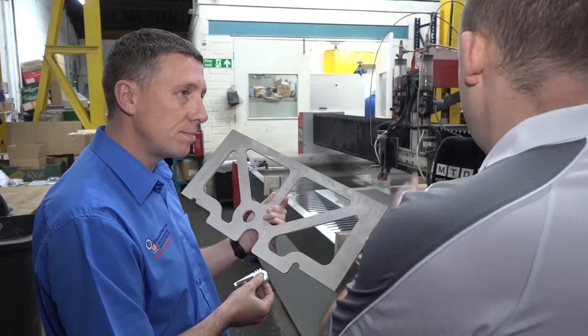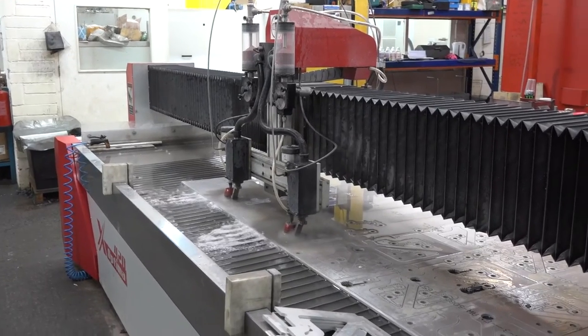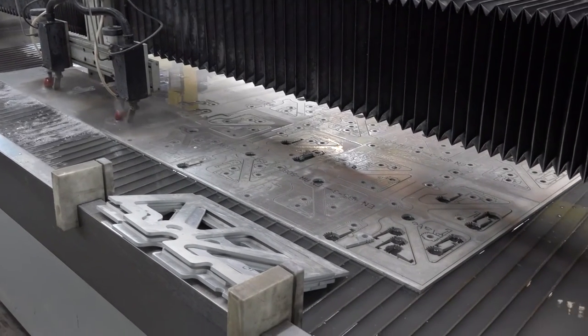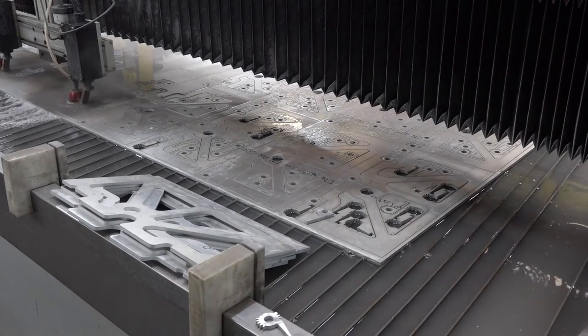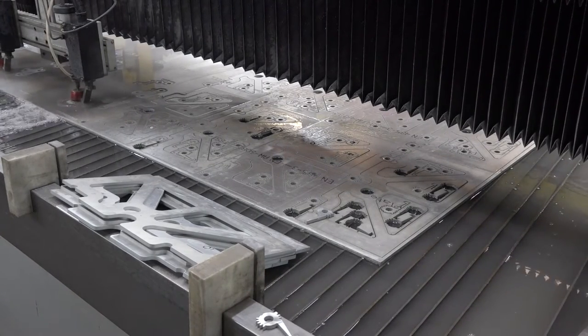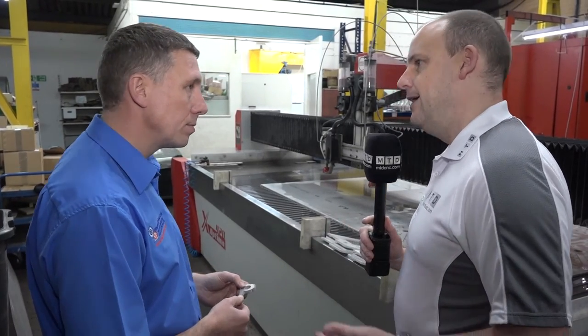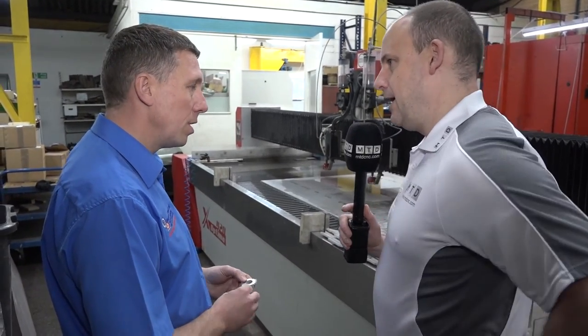The process is very efficient. The plate simply sits on the base of the machine — it doesn't need to be clamped, as gravity holds it down. The aluminium plate is 8mm thick and weighs around 12 kilos when finished. The interviewer also notes that someone had previously tried to laser cut these parts but couldn't because it was aluminium and the parts wouldn't stay flat.